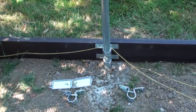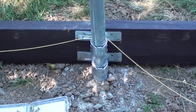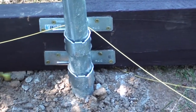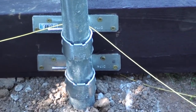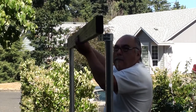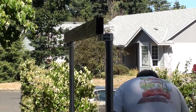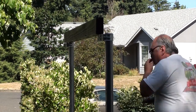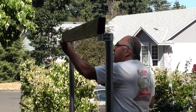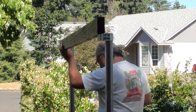Once I've leveled my two by sixes, the first thing I'm going to do is put on my brackets where the two by sixes are going to be located. I screw the brackets in, then screw the brackets to the two by sixes. Next we put the top rail on, then determine where our cross rail goes, check level, screw our brackets in, and screw our two by four in. This is how you do it by yourself.